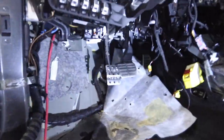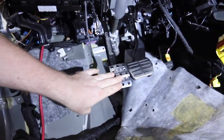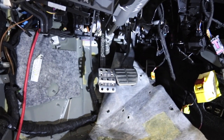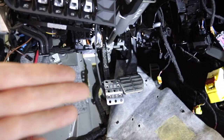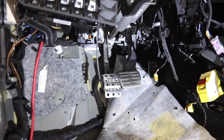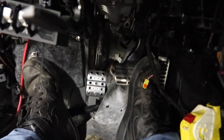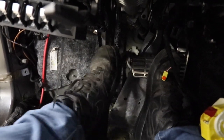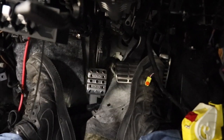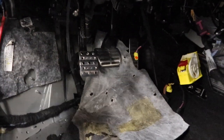Now coming around, connecting up to it — here is our clutch pedal. It's sitting off of the brake pedal about an inch and a half, two inches, so I can get full actuation going all the way down to utilize all of the pump. There's a full threaded rod right there that we can tune the pedal in or out as we need to. Once we get fluid in there and run the whole system, we'll tune it up how we like it. I was testing it sitting in here — brake and gas over here and then clutch. It's nice and comfortable, still has a resting spot for your foot. And even though it seems high up, you don't actually have to lift your foot at all — you just move your foot over and hit the clutch. It's very comfortable. It looks a little weird but it's actually very driver friendly and usable. So I'm really happy about how that turned out. That is the clutch mounted.